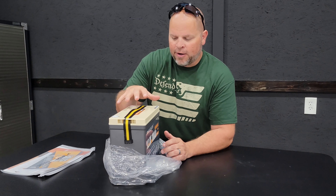Before testing, a couple of interesting items: you can install this battery on its side, on its top, or however you'd like — just don't put pressure on the terminals or short it out. That opens up a lot of design flexibility for building a battery bank. You can connect up to 16 of these together, building a bank up to 20,480 watt hours. You would series four together and then connect those in parallel, giving you a 48 volt 400 amp hour battery backup solution.